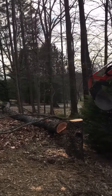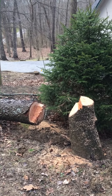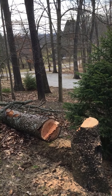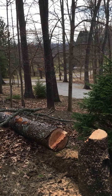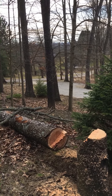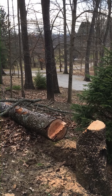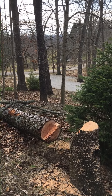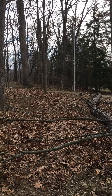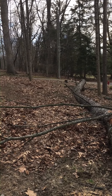Using my excavator to apply pressure to the tree, I then made my cut line and began the back cut, ever increasing the pressure from the excavator, slowly leaning the tree to upright and then pushing it towards the direction I wanted. I finished the fell by actually snapping the tree using the pressure of the excavator. Fortunately it all went well, but as you can see I didn't have a lot of room to play with. Excavators really are an awesome thing at helping in so many different jobs.